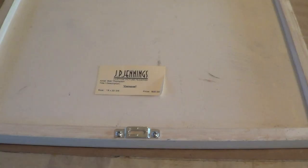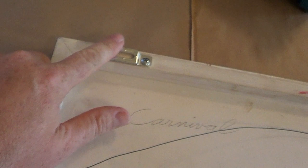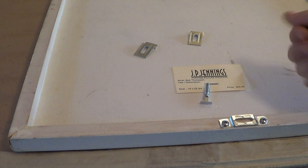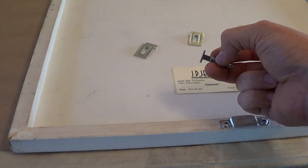Okay, that's the hardware mounted on the frame. This is the bottom — the one that locks it in place. You'll have two at the top and one at the bottom. As you can imagine, lining up these three points — two at the top, one at the bottom — with the anchors on the wall can get kind of tricky, especially when you're measuring and handling everything. So what I recommend is you build these little guys right here. These are called center points, and they're made by taking three of the anchor pieces, shortening them, and grinding them to a little point.